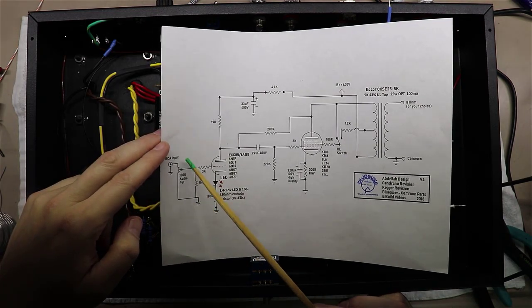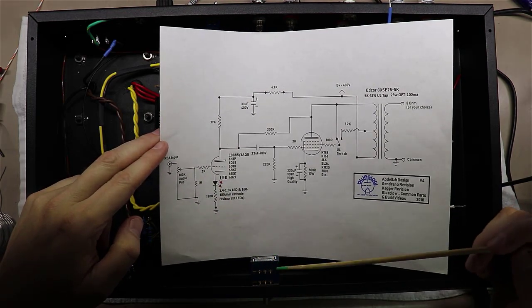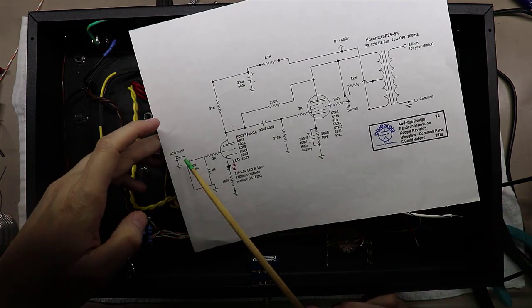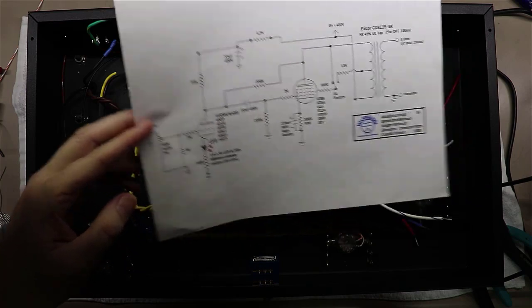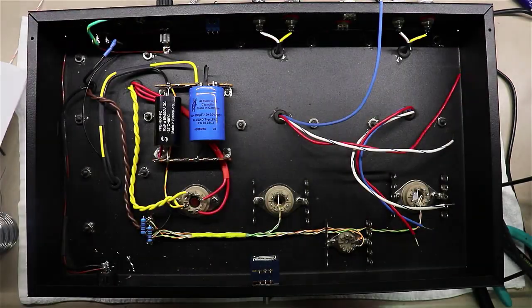The audio pot is another device that you only use one of, but it has a left channel and a right channel set of connections on it here. And then the RCA inputs, you're going to have 2 of, one for the left channel and one for the right channel. So for the most part, you're building all of this twice as we get into this.